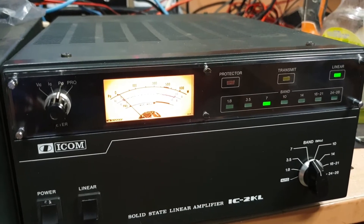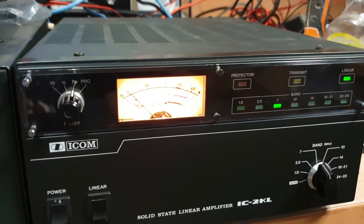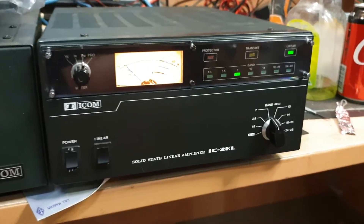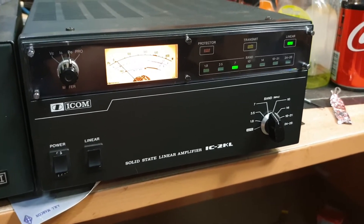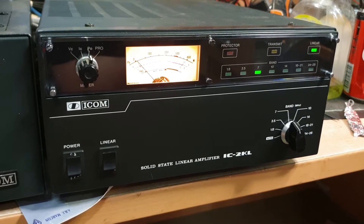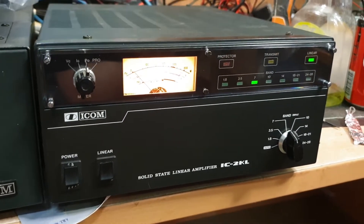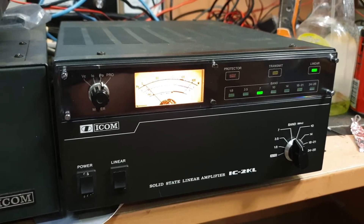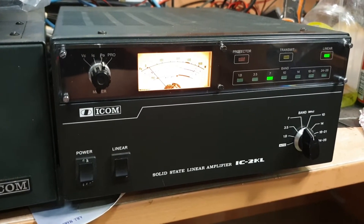People keep thinking a thousand watts is the only way to go, but with the right antenna you don't need humongous power. We've been running a lot less power than people think lately, just trialing things — seeing what signal we can get through without going too crazy — and it has been surprising. The 400 watts versus 200 watts, there's a difference but it's not as staggering as you think. From 100 to 200 watts there's reasonable gain, 200 to 400 a bit more gain again, but when you're already at 5-9 plus 15 dB into the US, running 2 kilowatts gets you to 5-9 plus 18 dB versus 400 watts at 5-9 plus 15 dB — you're really struggling to make a huge difference at that point.